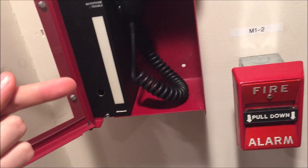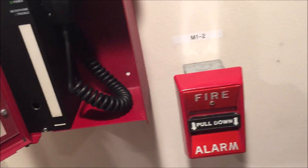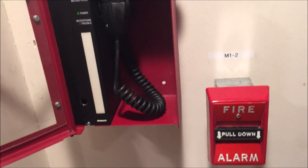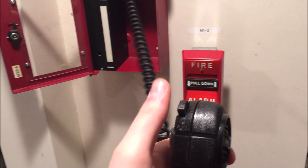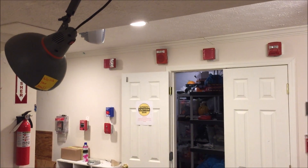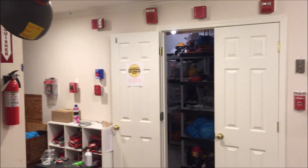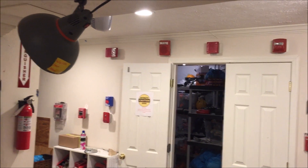So that push-to-talk relay controls my amp and power supply. I have nothing going into my audio in, nothing going into my trouble relays, and then audio out is basically just plus and minus into the plus and minus of the speaker strobe. Normally the strobe is off, but when you push the button it will start the strobe and activate the amplifier.